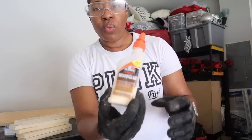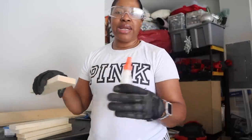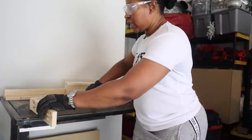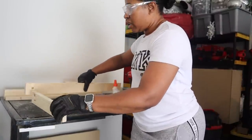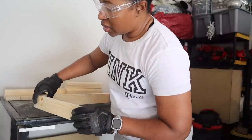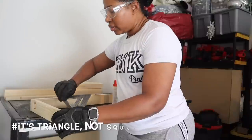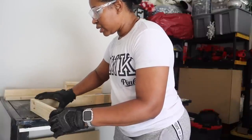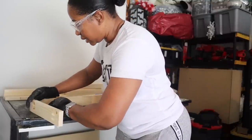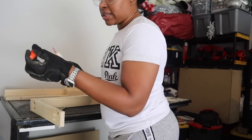I'm also going to use wood glue. I usually put wood glue on the edge, put the pieces together, then screw them together — that gives it a really firm hold in addition to the screws. Since this is one of my legs, I have the pocket holes facing the bottom so you don't see them when it's assembled. I'll use my square to make sure it's completely level, sit it in the middle, push it up against, and confirm it's correct before adding glue and screwing it in.